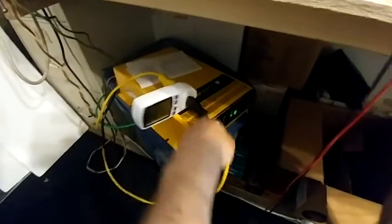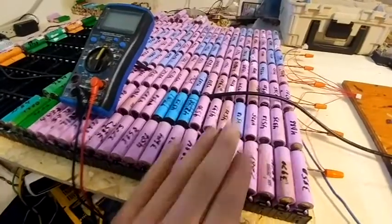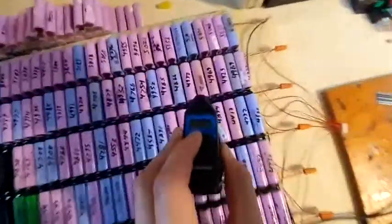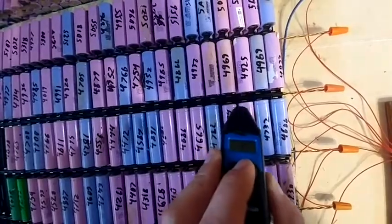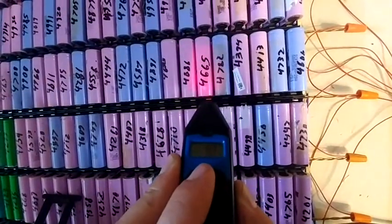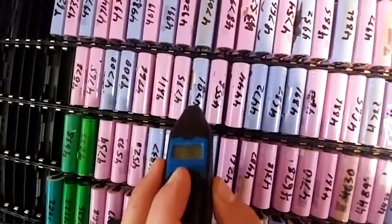Temperature — this is warm. It's normal that it would get that warm. These green ones warm up too. This thing's kind of a waste, but there's a warm spot somewhere over here. The bottom one's at 89, 92. There's a warm spot there — so there's one with high resistance, internal resistance.